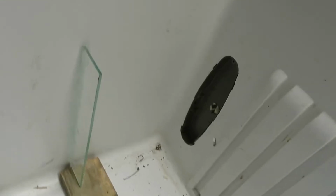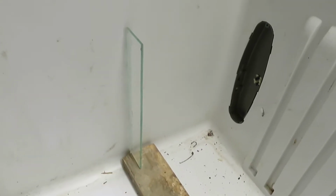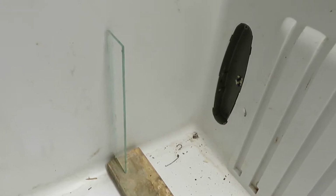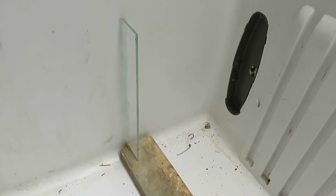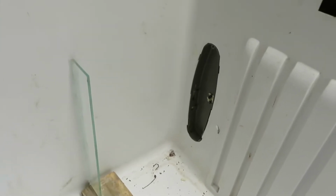And so the first thing we have to do is verify we can stick something on this plastic to be able to seal those holes. As we know, polystyrene doesn't accept silicone. It comes off very easily. But as this is a high impact polystyrene, which contains a butadiene polymer and rubber, I have the hope that it'll stick well.